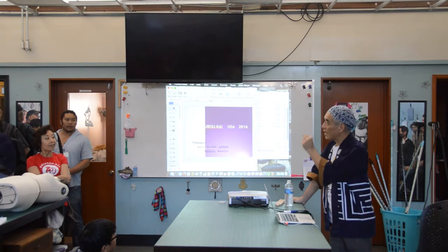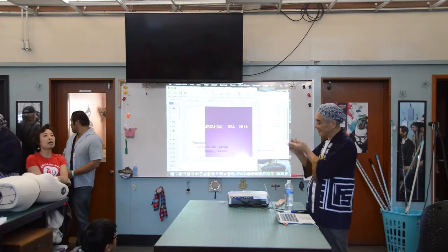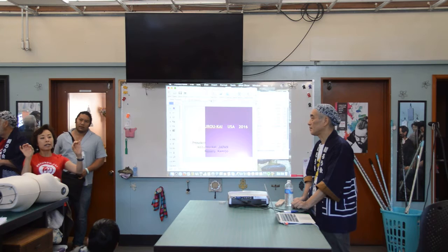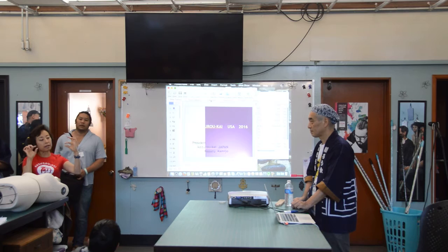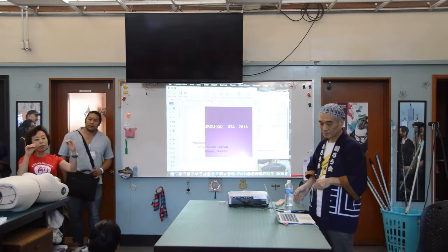The mouth opening can be 0.2 millimeters, the same as before. Even if you have a chipper blade, the opening can be the same as with just one plain blade. 0.2 millimeters width for the opening. You want to keep the opening as small as possible.